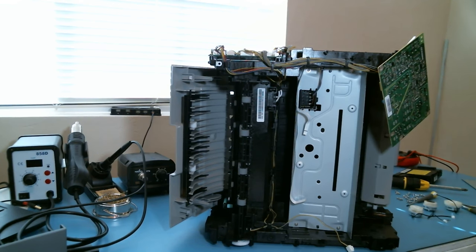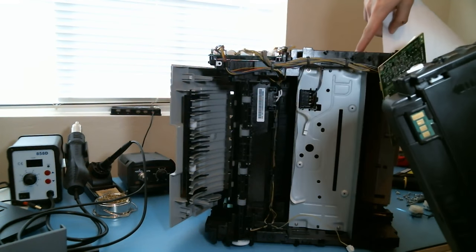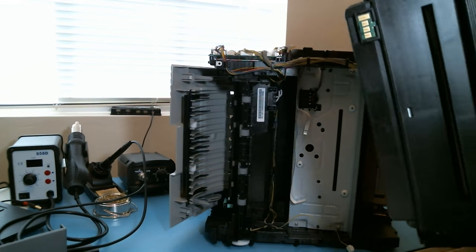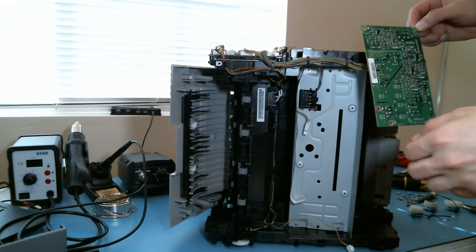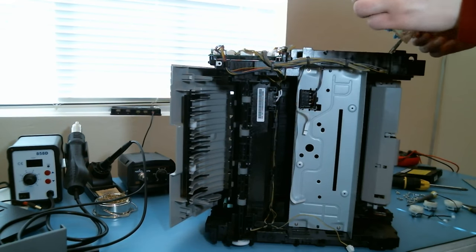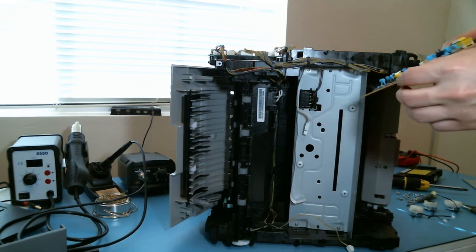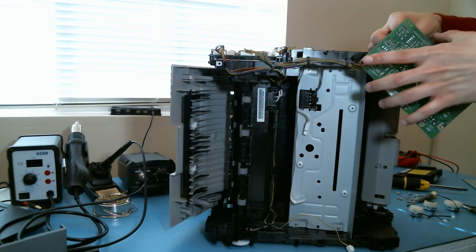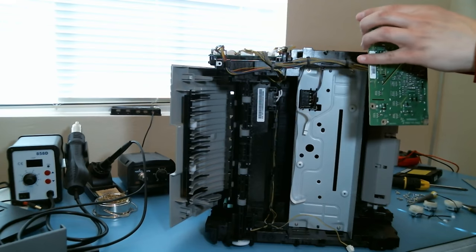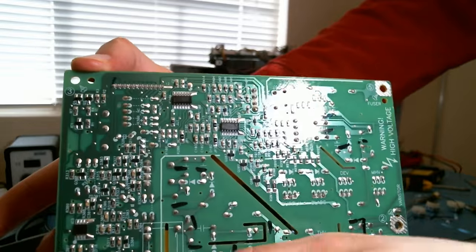Yeah. So here are these four pins for contacting toner cartridge. They butt up against these spring pins in there. Neat. That's really neat. So apparently toner cartridges require some high voltage. That makes a lot of sense, actually, since I believe static electricity is somehow involved. So I can see where they've sketched out an isolation boundary, so I should be fine if I'm grabbing the board over here. So in the silk screen, you can see this line.